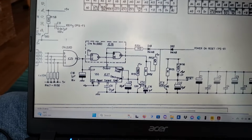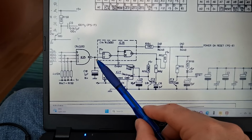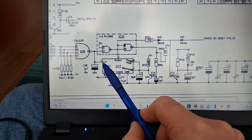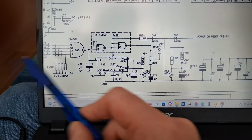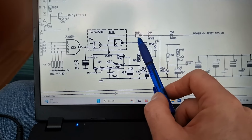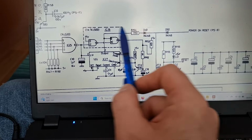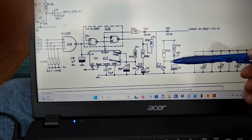That causes a couple of things to happen. It causes a high pulse to come up here. Because you're triggering this, that goes high. This one works the opposite way of the other one. The other one you want to stay high, this one you want to stay low. So that goes high, through here, through here, through ST48. It won't go this way because there's a low here, so it can't go through there. Current only flows in the direction of the arrow, remember. Down here, none of this are on. Pulled low, your board resets.